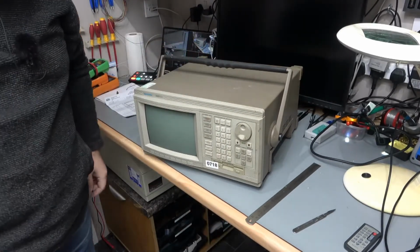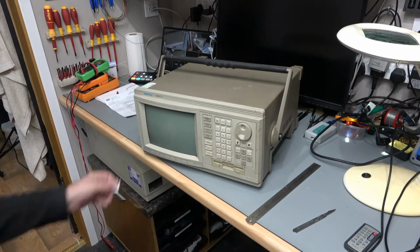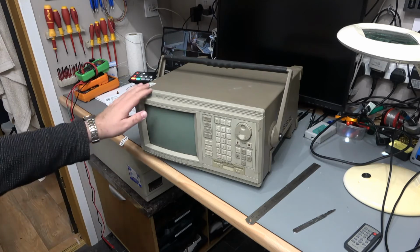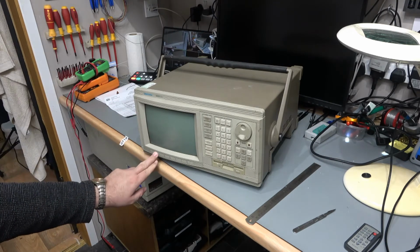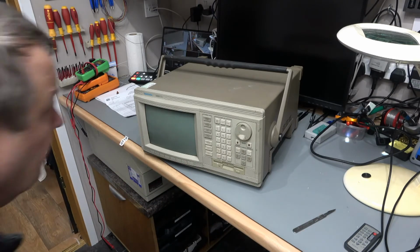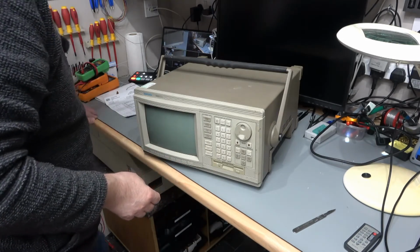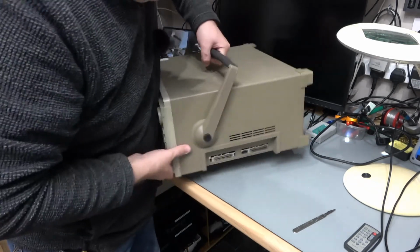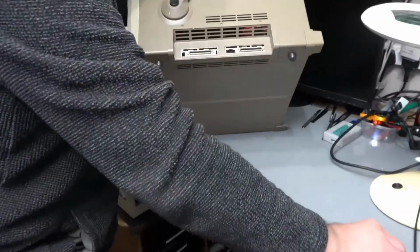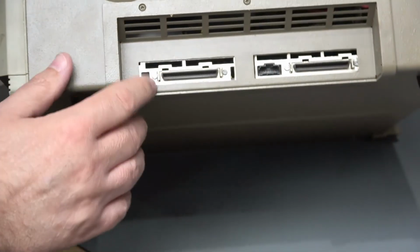Okay, there we go. So this is a Tektronix 3001 Prism. Yep, that's right. And this is essentially a logic analyzer mainframe, for lack of a better description. I'm not quite sure whether or not it's got the logic analyzer sort of pod adapters in it, or whether it's just the acquisition board. But anyway, we'll have a little look around it and see what's what. I certainly expect that this is going to need some repair, and certainly one of the problems is going to be the, so these are SCSI. So yeah, I kind of think that these are going to attach to the actual acquisition pods.